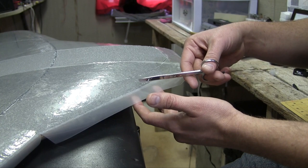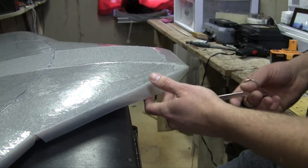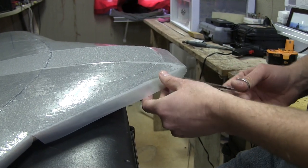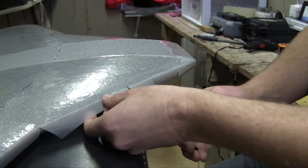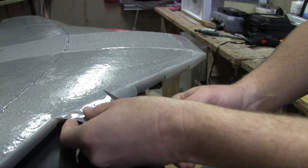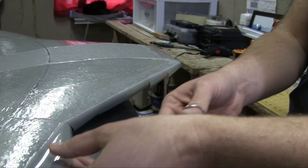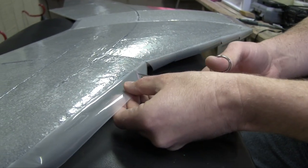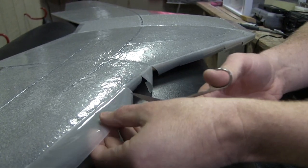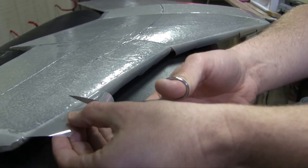What we're going to talk about now is how you can make wonderful edges on the laminate. A lot of people trip up here — they get the crinkles — but there's a real easy solution: flute the edges. It doesn't have to be measured out exactly. The problem when you're working on a whole edge and trying to put it down is you wind up with creasing in the laminate itself. Let me finish this one, flip the plane over, and I'll show you how easy it is.